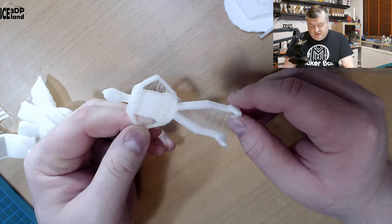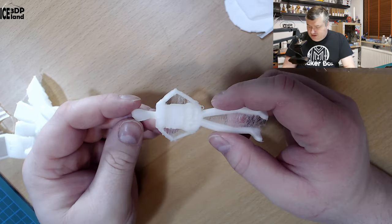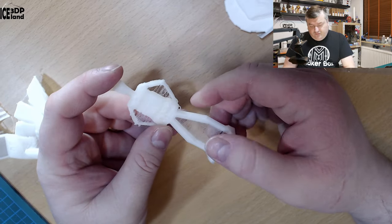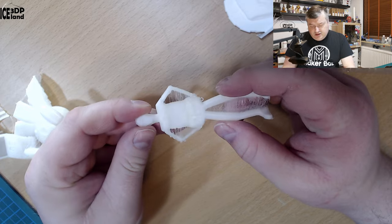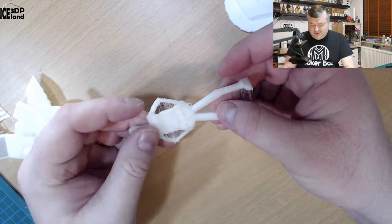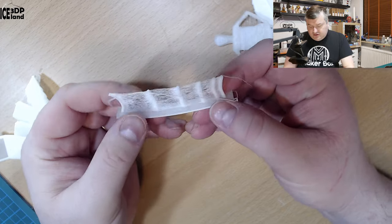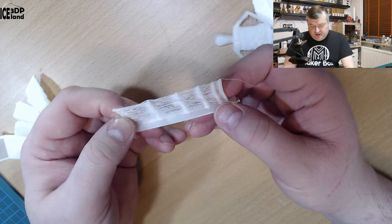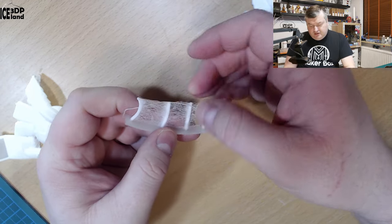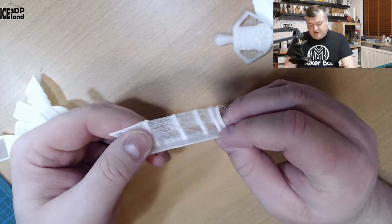I also printed Mr. Belly — here you can see the stringing issue. This was printed at 200°C, so there was no foaming occurring at this temperature; this is the base material. For TPU to string like that is not surprising. I printed another stringing test at 220°C, so there was a little bit more foaming and a little bit more stringing as well. That's something you have to take into account with TPU overall — it's quite stringy.